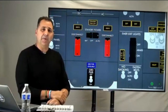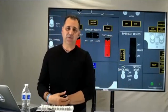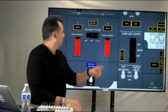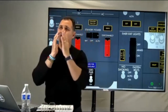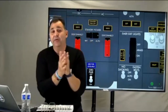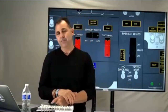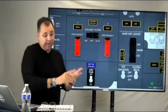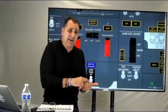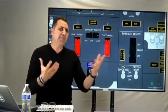What other ways can you see the drive light come on? If you have low oil pressure or high oil temperature, that drive light will come on. Also, if the IDG disconnects automatically, the drive light will come on. And if the engine is running and you disconnect manually with the switch, the drive light comes on to let you know that you disconnected. Look at how many things that drive light tells you.